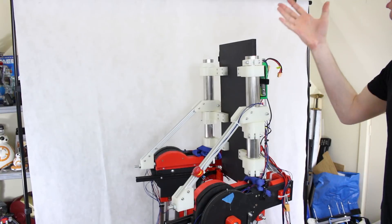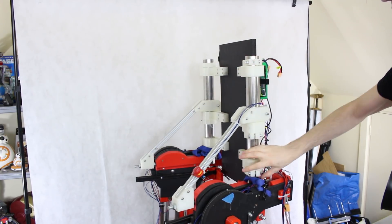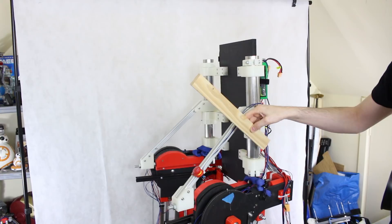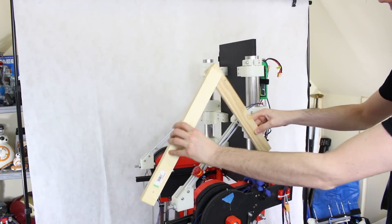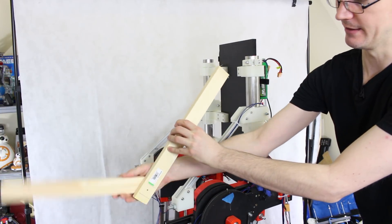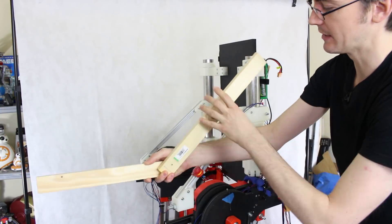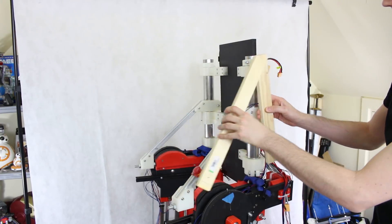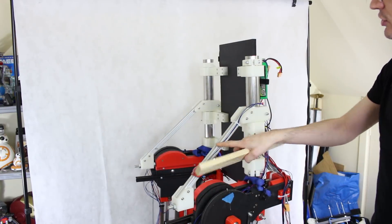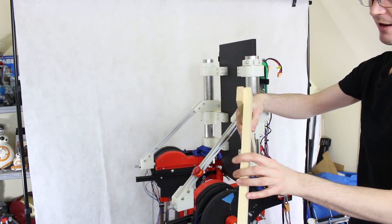The plan I've come up with is to put arms attached to these uprights, but I want the shoulder to move forward. I'm going to put the pivot point right at the bottom and have an extra piece that can pivot out — that's basically where the shoulder is mounted on the other end. My upper arm would be mounted there, giving me this sort of motion; then my elbow is here. Whether these pieces are longer and my actual hand comes halfway up the forearm with a big gripping hand, I don't know yet. For now we're going to work on this mechanism and allow it to rotate round as well. There is a bit of an issue with the piece that holds everything parallel, so we'll probably have to start further out to get some rotation.